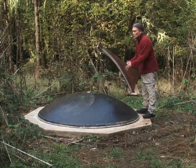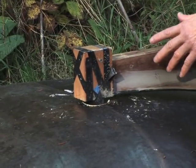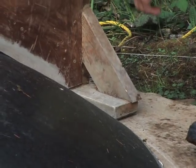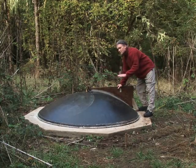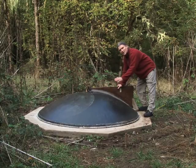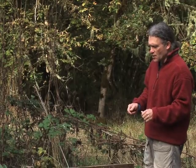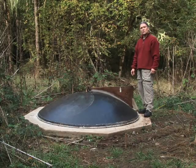The principle is very simple. We create a shaping tool with the parabolic curve and then establish two reference points — a pivot in the center and a flat surface around the outside. When we rotate this shaper around on this surface, we form out a paraboloid shape. We fill this in with rubble and rough material, then finish it off with fine materials. I chose cement-based products to create a heavy duty model for experiments here in the sustainability technology program at Lost Valley Education Center, an aspiring eco-village teaching permaculture south of Eugene, Oregon. Experiment using your own local materials and have fun.